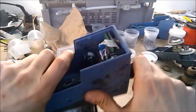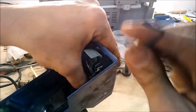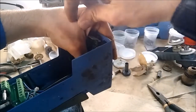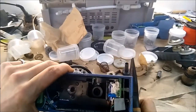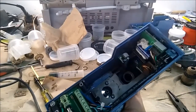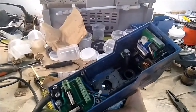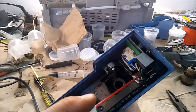With the set screw facing up, pressed in all the way, grab it from both sides to make sure the wavy washer is fully pressed down — that takes up the slack when you work it back and forth. It's moving fairly freely again — that fixes the spindle. Throw a little bit of lube in here too. It's best to use the paste as opposed to the aerosol so you avoid spraying unknown solvents over your circuit boards, even though white lithium grease shouldn't matter.